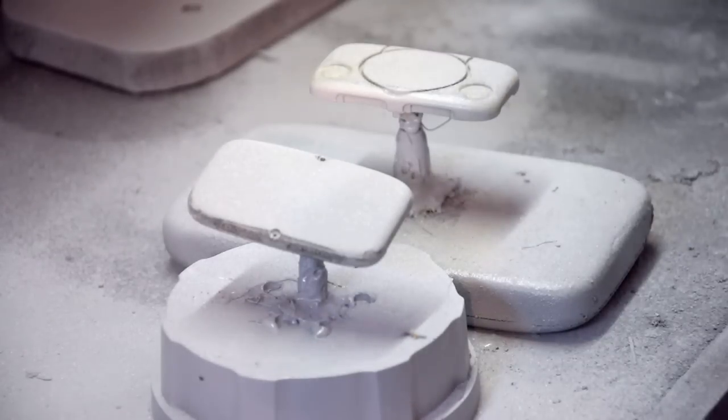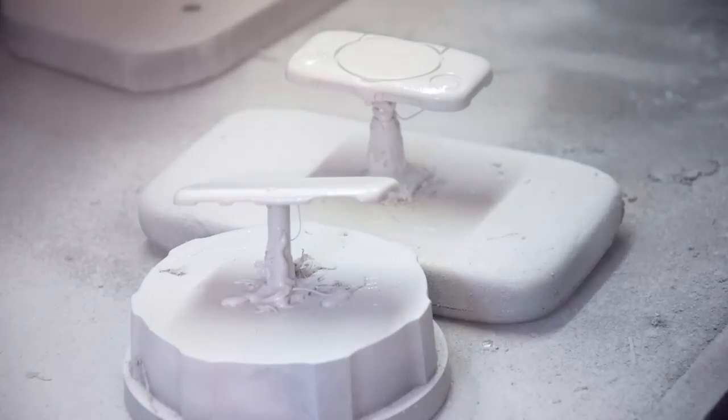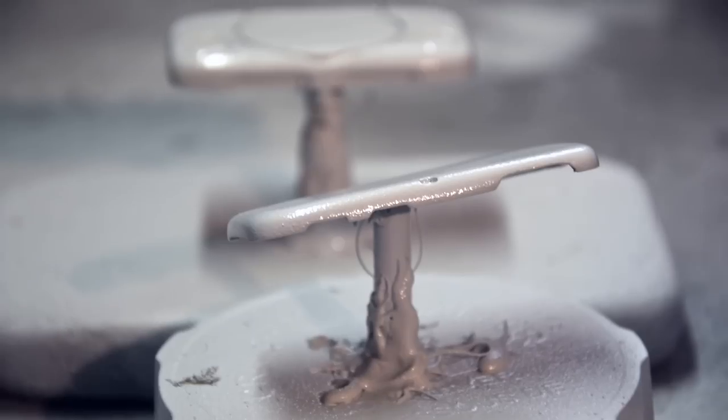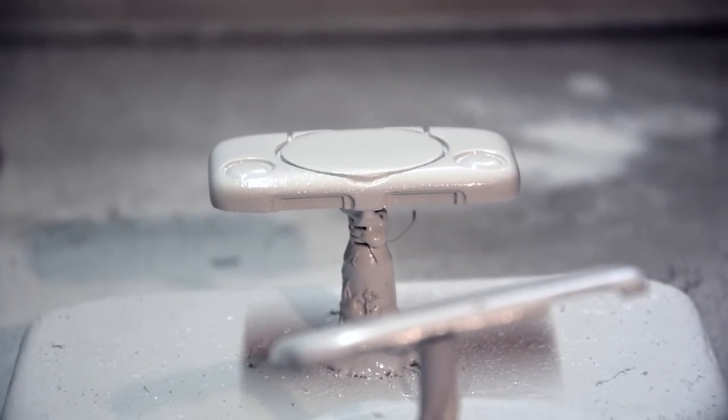The paint is applied as evenly as possible. This final coat can be a little thicker than the previous ones so that the surface is smooth. After painting, there seemed to be some small bubbles in the paint — thankfully, they disappeared as the paint dried.